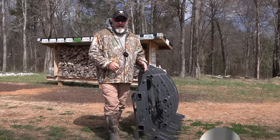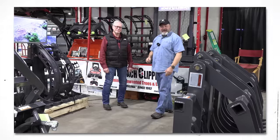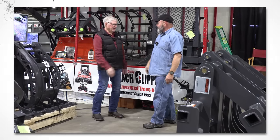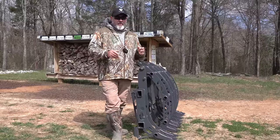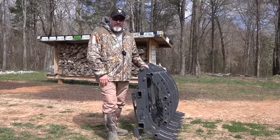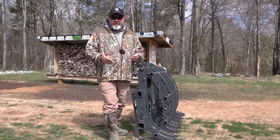So this grapple is made out of AR-400 steel. And we did a video with Mr. Bill Reed. He is the owner of Precision Manufacturing, and he really broke down why different types of steel are important. Your entry level grapples are not gonna have greasable points, and they also are probably gonna be made out of very mild steel, which bends easy.